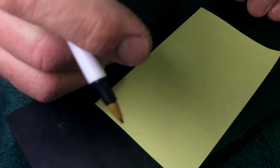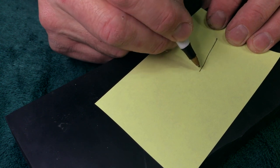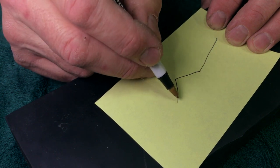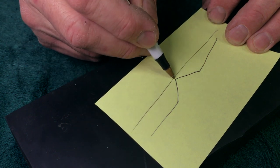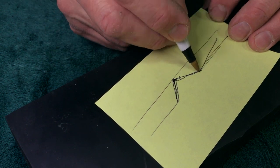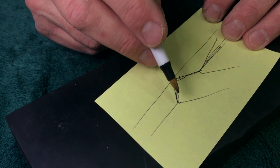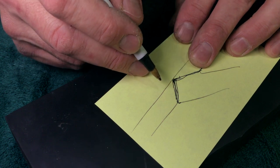Because what happens is, if you look at the striation at the edge, now this is going to be hard for me to show because I'm not a good artist. But say that's the edge. Well, whatever. Let's say that's the striation. This is actually the edge. So the striation comes down to here. It terminates right at the edge. And this is just like the rest of the blade. And then this takes off in that direction. And then there's a whole bunch of these in succession. They all butt into each other, hopefully.